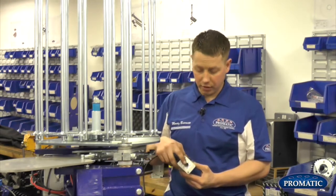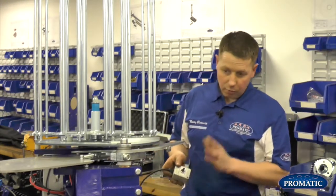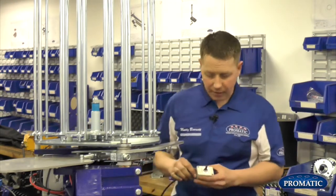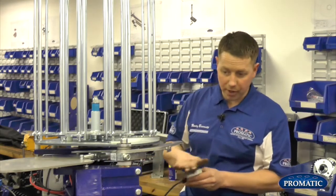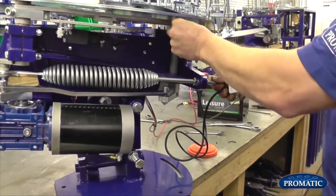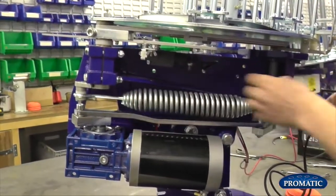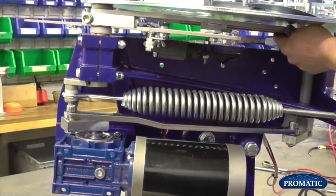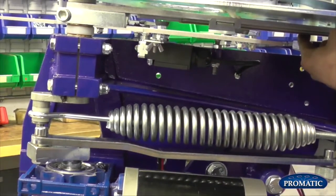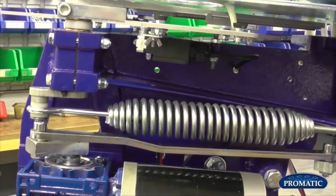If we take it up to off, disarm, you see the trap has fired, but the trap hasn't re-cocked. When we were talking about the clock face before, when we were setting the rear pusher timing, we are now in the 12 o'clock position. Now, to make this machine perfectly safe, we will nudge it round so it comes to an 11 o'clock position. Basically, now we can push the arm under, and we see that the gap between the pin of the main shaft and the drive bolt on the crank is actually getting smaller. As we're pushing, you'll hear a dung. This is the actual trap firing. The machine effectively has fired, so it's gone over center.